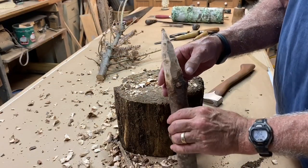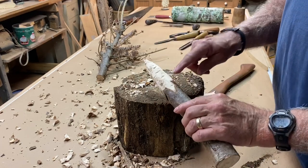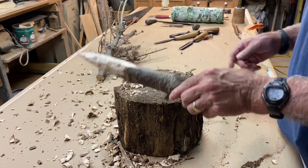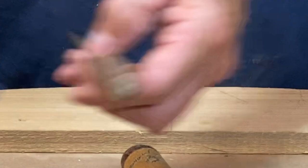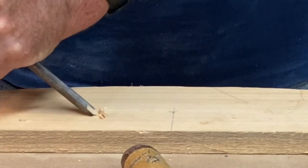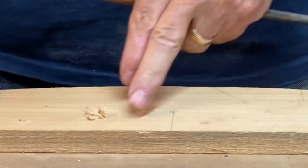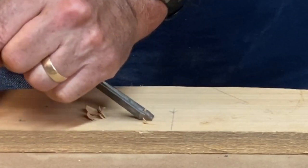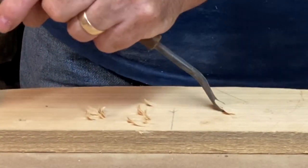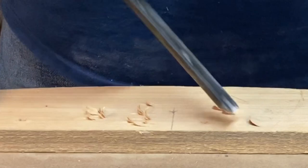I'm pretty happy with this shape — symmetrical all the way around. I don't have to worry about getting rid of these little chip marks. So I'm ready for the next step. For this next step you need to decide which chisel you're going to use, and you can make some practice cuts on a scrap. This chisel tends to really turn the chips up; this is a veining tool — it's going to make very small cuts. This is kind of a spoon shape. I like this one.